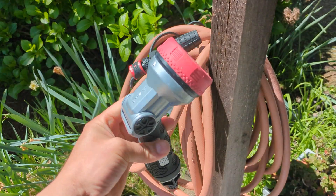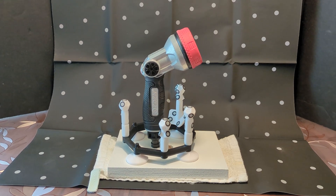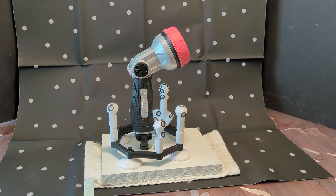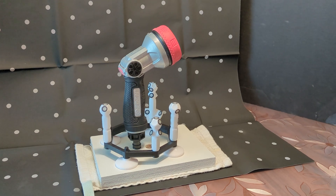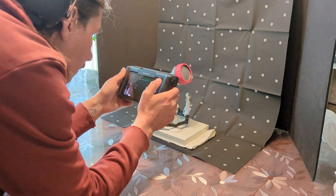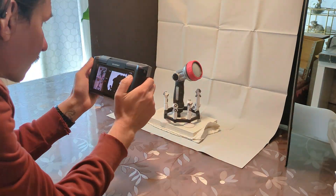So this time I'm going to be doing it differently. I'll be scanning it with my RevoPoint Miraco. Instead of guessing at shapes and dimensions, I'm going to scan the actual sprayer and use that as the base for my design. I'm still very new to using this scanner, and this is the setup I thought would work: dark backdrop, lots of markers, including the marker towers. I set everything up and started to capture, but the black grip and other features weren't capturing properly, and the towers just seemed to get in the way.